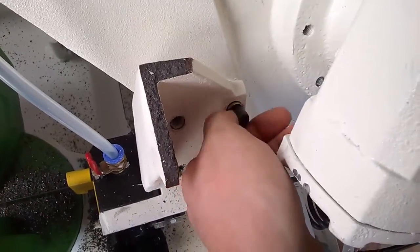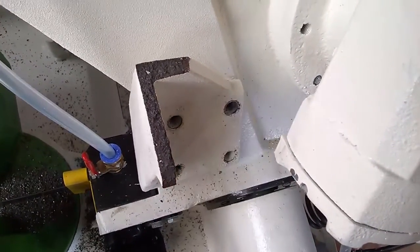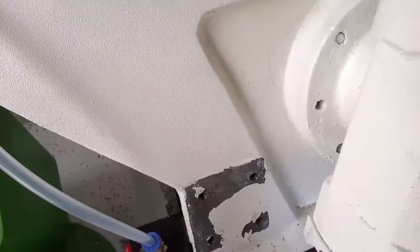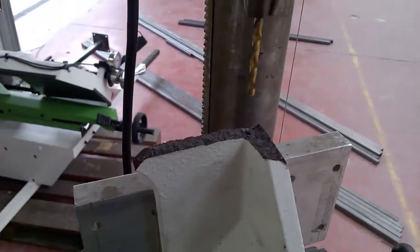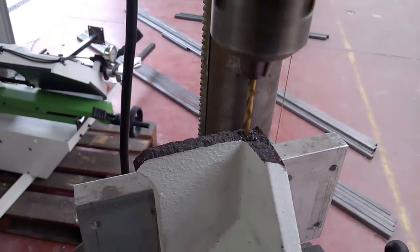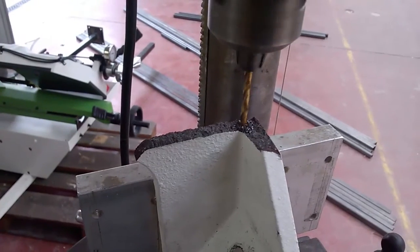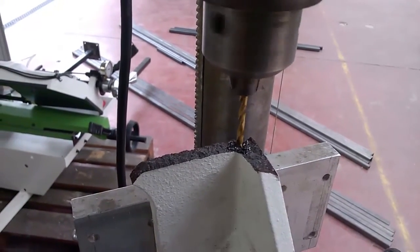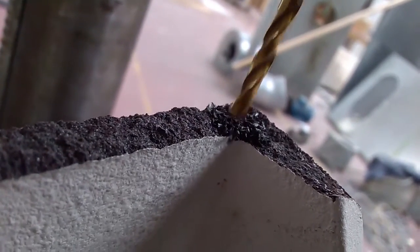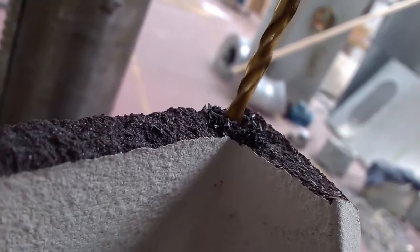On the top piece the through hole was 4 millimeters. The casting, as you can see, has two different thicknesses — on the thicker part it's 9 millimeters thick, and on the thinner part it's about 6.5 millimeters thick. Here I'm drilling a few holes to get them tapped with the M4 thread tap later on.